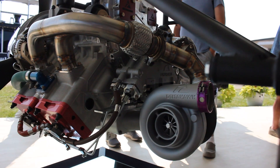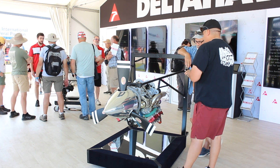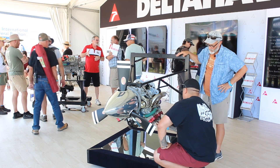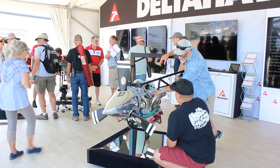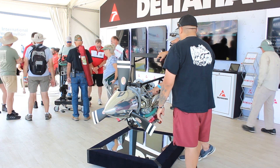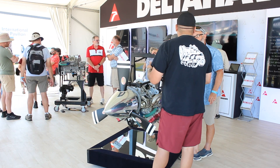We also have ports for the probes, right? When you go to inspection intervals, there are glow plug ports — there are glow plugs on this — and you can simply take it off and get right in there and see the cylinder. And these guys up here are going to be really good inspection ports. There are four of them, so on each side you can get in there and see the bottom end of the cylinder. Literally if I pull these, I can put a borescope in there and see the crankshaft — correct, right there. And the setup has tells on the flywheel itself that will tell you where top dead center on cylinder one is, so you don't have to sit there and guess.